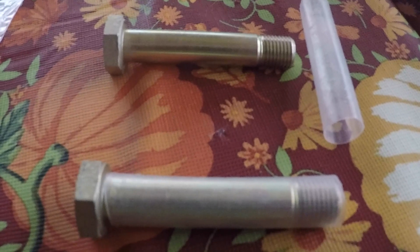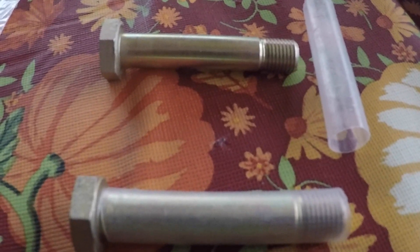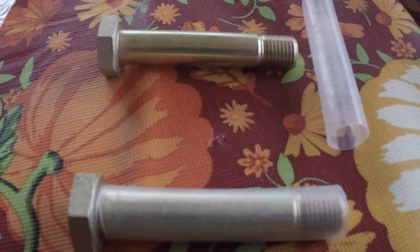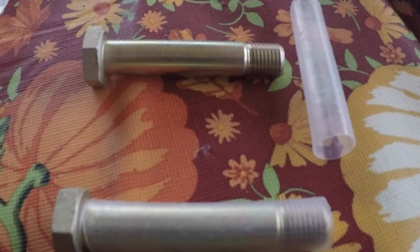If you do have shock absorbers, your bolt is a dash two longer — so it's a quarter inch longer. These are the NAS6207 dash 29s; the longer ones are the dash 31s. They're a close tolerance bolt and come with a protective cover to protect the close tolerance shank.